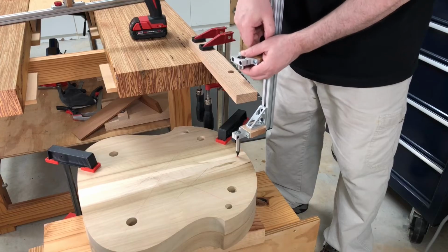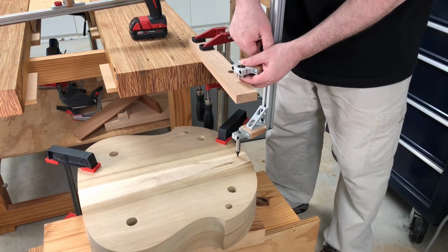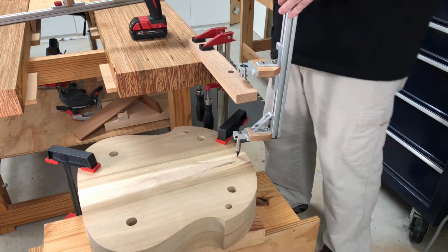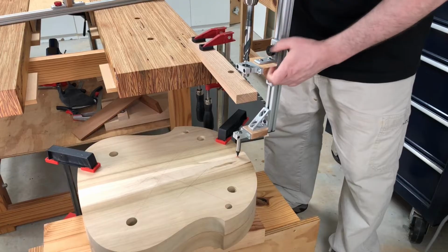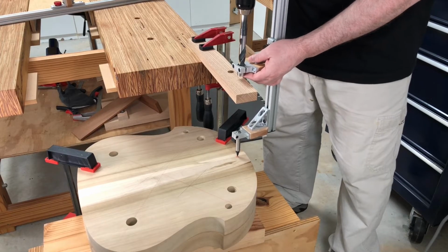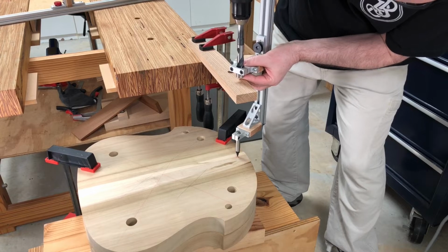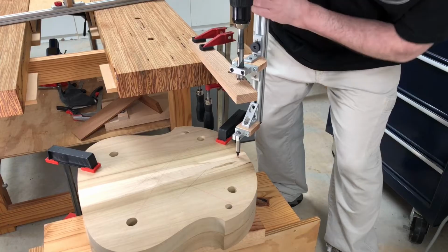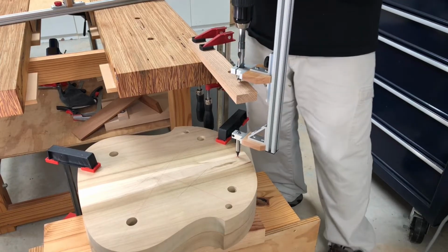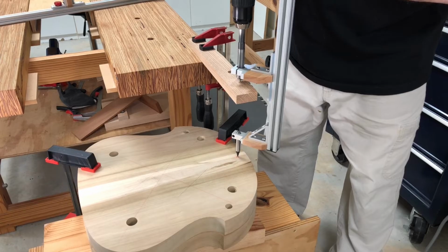And we're adjusting the movable carriage to where it's about a finger width above the test board here, or our test arm bow. And next we'll be inserting the 5/8 inch bit into the bushing on the guide, and then making sure that that aligns with our pinprick representing where our spindle mortise would be in the arm bow. At this point, put some slight downward pressure on the guide and drill away.